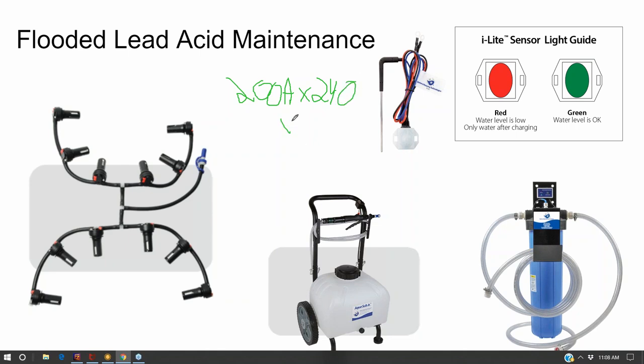Multiply that together to get your power, that's 48 kilowatts, which is plenty of power for them. But our inverter is only 12 kilowatts with a 20-second, 36-kilowatt burst. So for like cranking on the compressor.